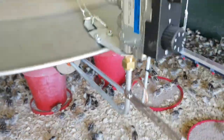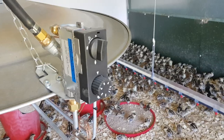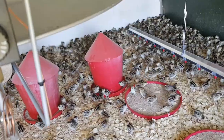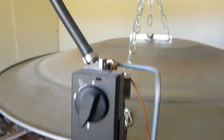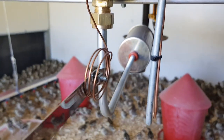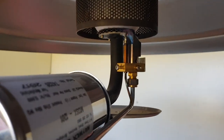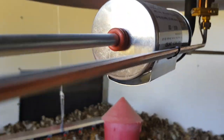It's a proper LPG-approved gas valve, not a radiator valve which has been adapted for the purpose. And this is where our system is different. There are two gas pipes which leave the control unit. The first one doesn't go through the controller — that goes to the pilot light, which you can see there on the right-hand side. Then the second tube comes out, runs along through the air inlet dust collector into the main burner.